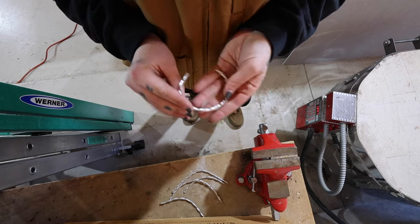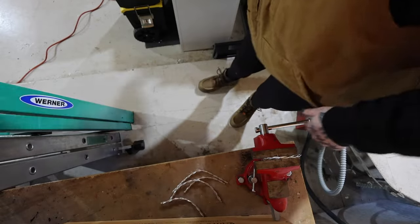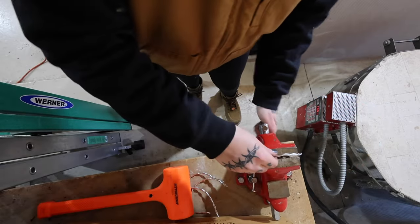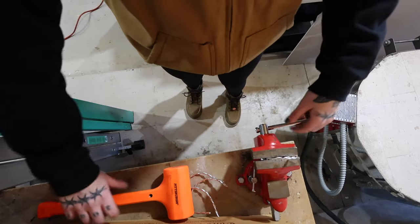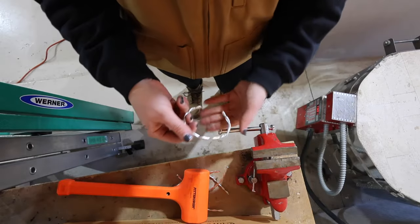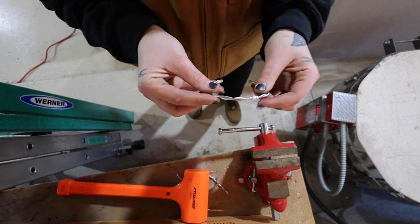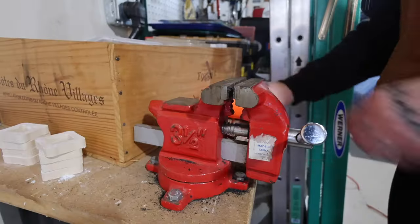For the top of the wrist I have this initial bend, then I go about a third of the way in on each side for my second curves around the sides of the wrist, and tweak from there. I also like to use the mallet to help form the shape — it's not super technical, kind of whatever feels right. After I have them try it on I'll probably tweak it some more, but that is the basics on how to make a bracelet out of filler rod.